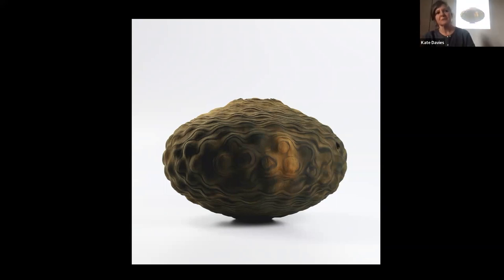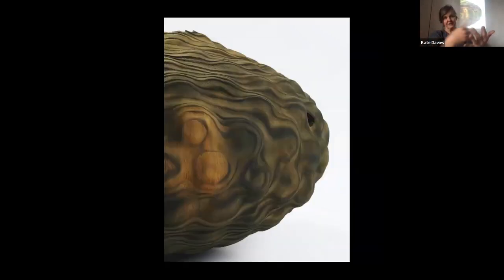And there's a moment when the sun is setting, when this kind of gentle yellow light sweeps around the valley. And so I wanted to make a piece that reminded me not just of what you can visually see, but how that made me feel. So this piece was deliberately turned end grain into the end of sequoia so that I could catch the edge of it in the sap, because the heartwood obviously has much more tannin than the sap. So by putting iron solution on it, I was always going to have this kind of yellow flash where it had dipped into the sapwood.